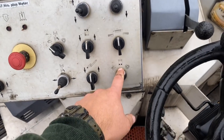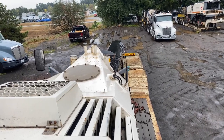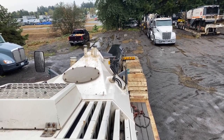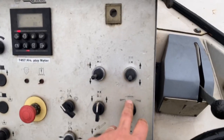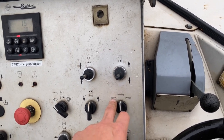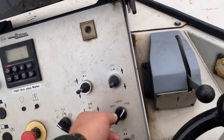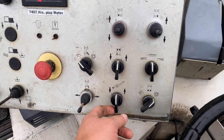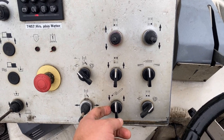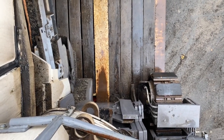This will adjust the front end for you — you'll see there's a rod that's right in the center. I'm going to lift the machine up and see how that rod's sticking up. This little function right here is for your slope control — I'm set on level ground, but if I was grinding a roadway that slopes to the right I'll have it here, set it to there if I'm sloping to the left. This is for the shoe that picks up your tailings and shoots it out the front end of the truck — if I'm traveling I'll pick it up so it's not just dragging on the roadway.